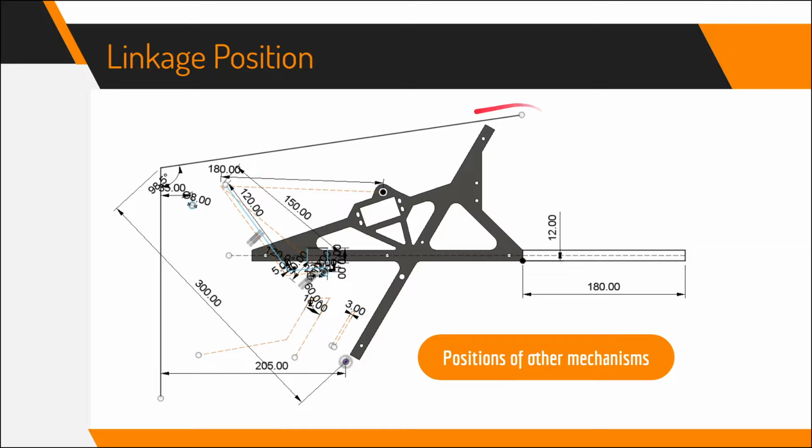This is a side view, and we had this angle so that we can lift up the stage door, so we can't have the linkage extending out of it, or else the linkage itself would hit the stage door, and that would be really bad. We also have this other axle for our climb mechanism. And we sketched out a very brief sketch of an intake, so we can figure out where we want the claw to be and where we want it to go.